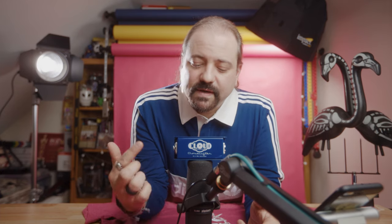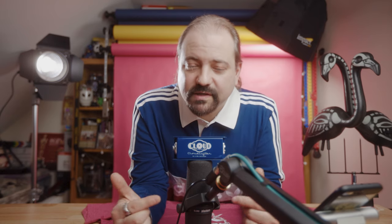If you don't want to spend the money on getting this device, you don't need to get it, but just remember that once you plug in this microphone and give it all the gain you need, you may be introducing some noise in your recordings. And it also depends on the acoustics of your studio, the sounds that you have around your studio, if you have a really loud AC, for example. And yes, of course, you can do some noise reduction in post. However, that will degrade the low frequencies in your recordings and therefore the fidelity of your voice.